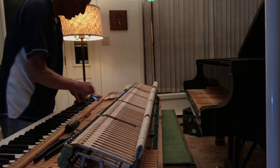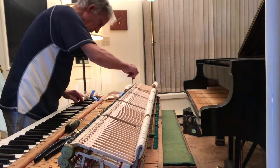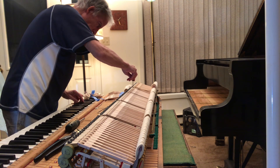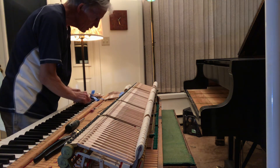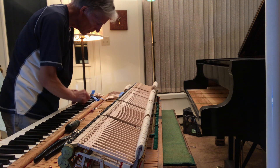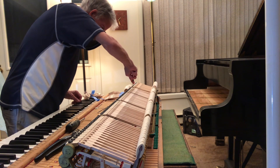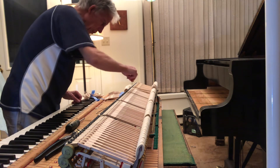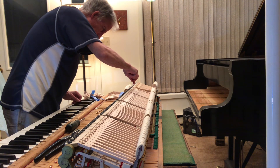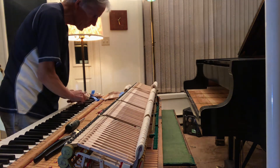Now I've got it there, so I've got to go back and adjust the drop screw. I go very slowly up and I want it to drop just a sixteenth of an inch. That's a little too much, so I've got to turn the drop screw — get it into that slot and turn it back up a little bit. Still a bump to it — I want it to be just smooth, down a sixteenth of an inch. There — perfect.